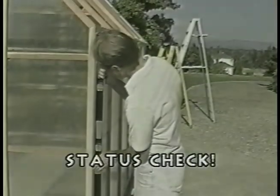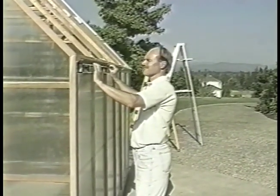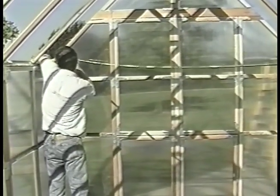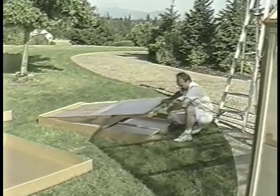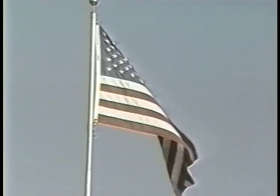Check over your work now before you continue to make sure the roof panels will fit. Make sure the sidewall top plates are square and level, and the roof ridge should also be square and level with no sag. If everything does not appear to be square and level, adjust it now before continuing. From box number two, locate the four roof panels, and from box number seven, two vented roof panels. Please note roof panels are not interchangeable — they are not identical. Start by installing the vented side of the roof first. Locate the vents on the side of the roof away from the prevailing summer wind.